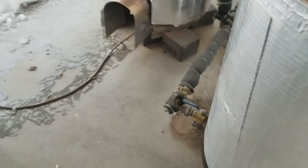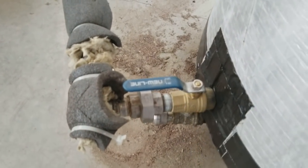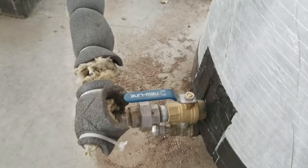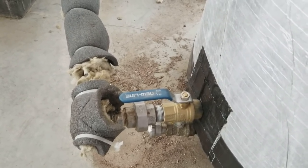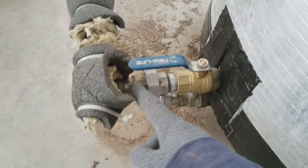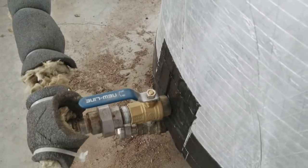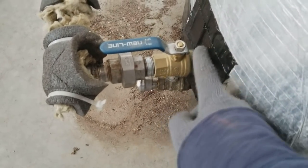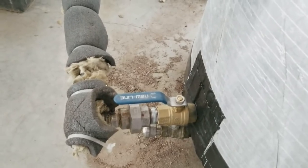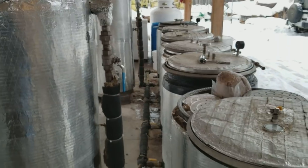This is our original setup with the 55-gallon barrels. Right now this valve is attached to the steam barrels, but we're looking to detach the steam tanks and reattach new ones to sterilize every day or every second day. This valve is going to get attached to the steam pipe header, and a union will attach to the valve and then to the steam tank. We're looking to have a union quick-disconnect connection so tanks can detach, cool down in a designated area, and then we can reattach new tanks and do a lot more production.